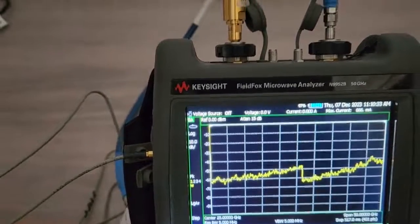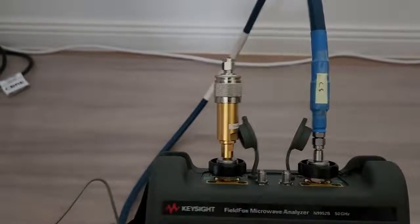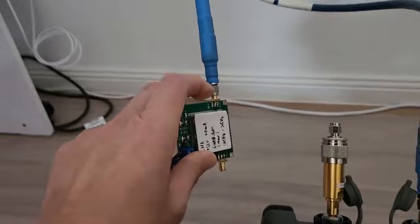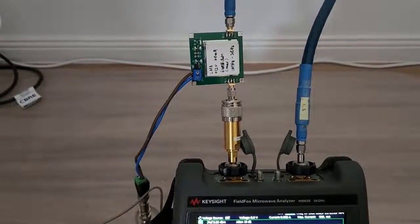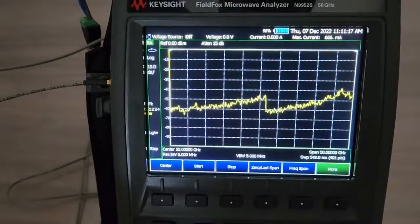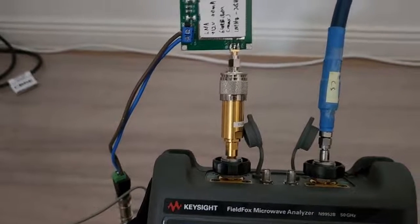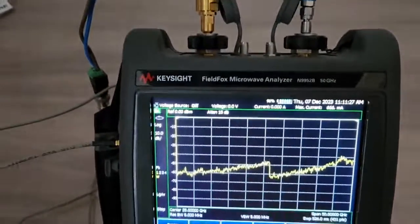So I'll go with SA mode. We can pump a signal from port 1 and measure at port 2. This amplifier has its input at the bottom and output on top. After the connections, we have the DC power supply, the input and the output, all connected back to FieldFox. FieldFox will be pumping out a signal from port 1 and measuring the output.